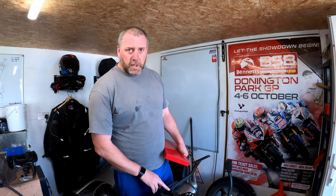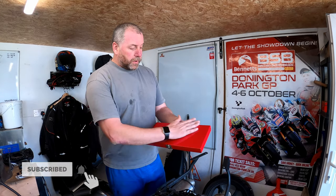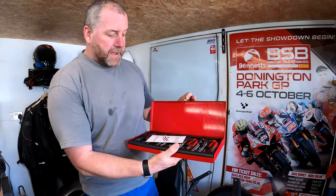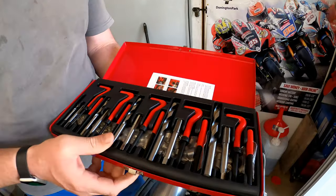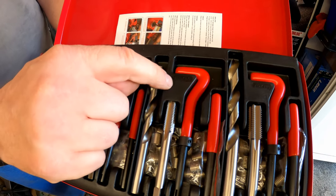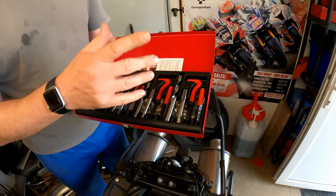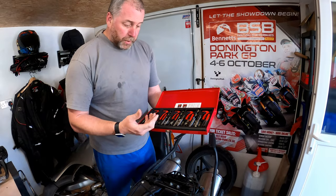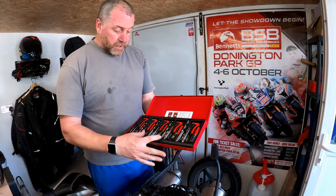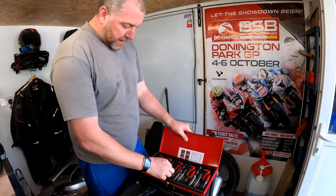The process by which to fix this problem is pretty straightforward, but you do need a couple of things in order to do it. What I've got here is a helicoil repair kit. This is a fairly comprehensive kit which includes many different sizes of repair. As you can see, we've got M5 by 0.8, M6 by 1.0, M8 by 1.25, M10 by 1.5, and M12 by 1.75, which are all pretty standard bolt sizes and thread pitches. This one I happen to know is an M8 by 1.25, so this is the section of the kit that we're going to use.